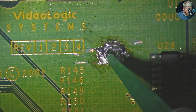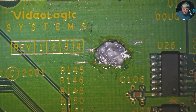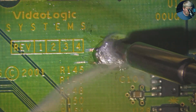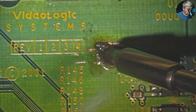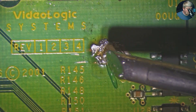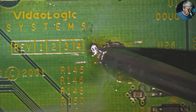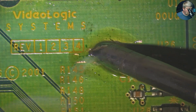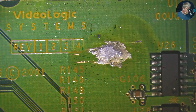The flux is going to absorb a bit of temperature since it's a liquid. I'll keep it at 400 degrees and let's have a look. With 400 degrees and flux on the PCB, it's managing really well with the BC3. Let's now swap to the BC5 - the bigger tip - to see how it performs. I've installed the BC5 and set the station to 350 degrees. With 350 degrees and the BC5, look how nicely the soldering is done on a big piece that needs a lot of heat transfer to the PCB board.